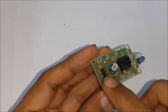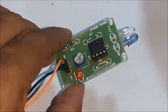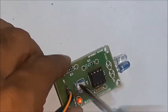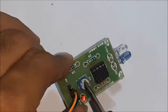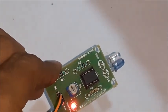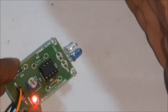This is the IR sensor module. Connect a 5-volt DC supply and test its sensitivity, then adjust the trim pot for maximum sensitivity so that the LED just goes off. Again test that your hand is recognized from a little far distance and the LED glows accordingly.